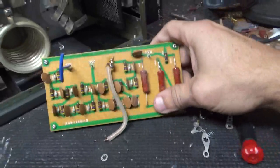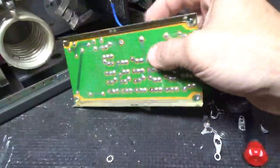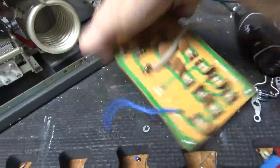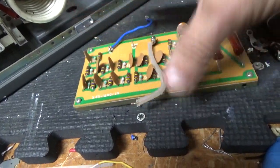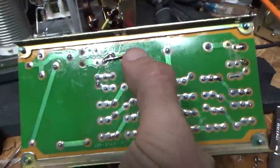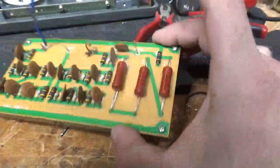I didn't have any success — I had to pull the board out. First time out of over 700 I've seen someone do this. You can see how the solid conductor goes through and solders to the trace, and you can see it is loose. I also noticed that whoever worked on it prior damaged one of the ceramic disc caps — probably hit it with a soldering iron. So I fixed the board, replaced the cap, cut a new piece of solid copper wire, went through the hole, and soldered to that part of the trace extending it beyond. First time I've ever had to do this.